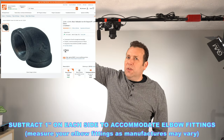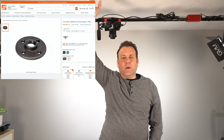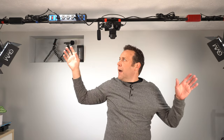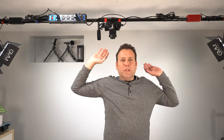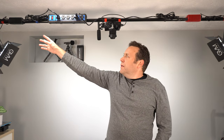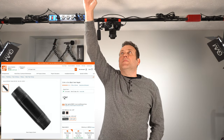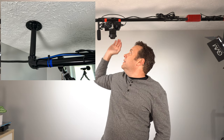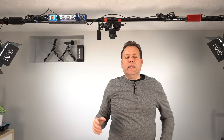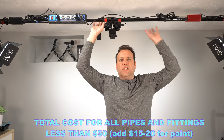You're starting off with a flange, and that's what will actually mount to the ceiling. You're going to use a stud finder to find out where your joists are and mark them. I could have done 6 feet, but I'm really happy I went with 8 feet because it gives me a little bit more range to put the lights out further. The down pieces of pipe are 6 inches, which gives a little bit of room off the ceiling. This has a monitor on it so it sticks up a little bit, and I wanted everything just out of camera view but where I could reach and adjust everything.